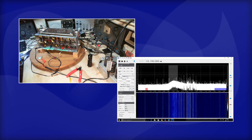Now this is an FM radio, so it's not supposed to be sensitive to things that affect the signal strength coming into the radio, like those peaks. Those peaks should not generate a noise in the speaker. But that has a lot to do with the limiters that are in the radio, or the limiter that's in the radio, and how effective it is. Kind of pulsing a little bit there too. I can see it in the waterfall display below.